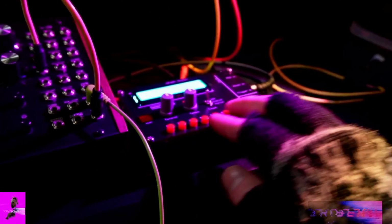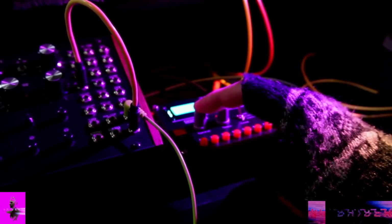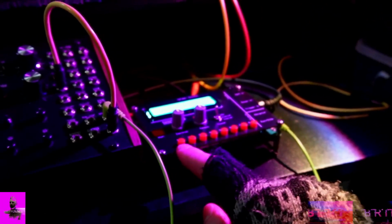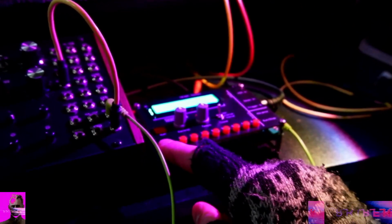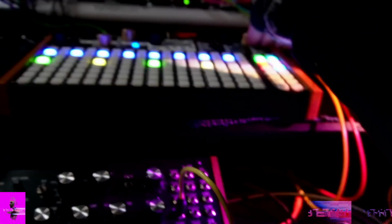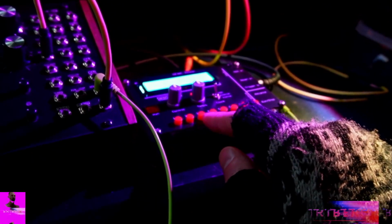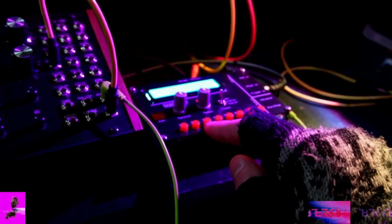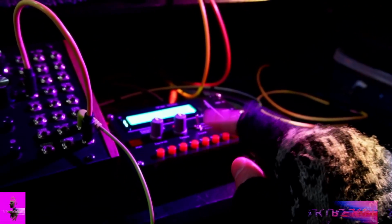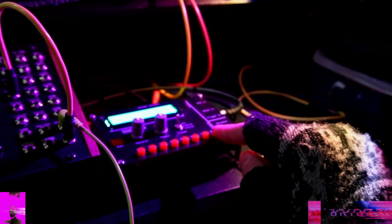On top of that, it's not just for shortening the sequence length. If you hold down the button that is part of this potentiometer, it becomes like a shift function. And these 8 steps become a clock divider or clock multiplier. Switches 1 and 5 bring the clock back to its regular division, which I'm not sure what it is. It's aligned. Whatever that means. So steps 2, 3, and 4 are all multiplications of 2, 3, and 4. So double clock speed, triple clock speed, quadruple clock speed. And over here, you'll then be able to reset it on step 5, and then you'll be able to go half time, third time, quarter time. I'm pretty sure.